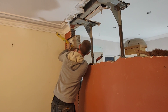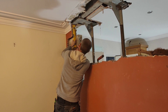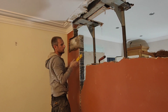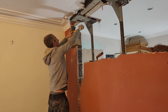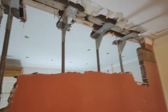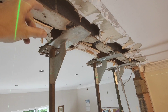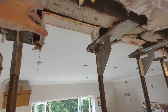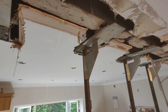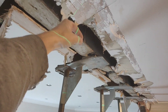If we pull that back a bit - up a bit more, yeah - it's quite a bit more up, yeah. It's a bit high up front. Right, I've got them set up ready for the steels. We've got a couple of shims under each end so the steel doesn't sink when we put it on, then we'll wick out this gap. We might have to dry pack some concrete or we've got some concrete brick. We're just going to put it on and see what it comes to because we can't squeeze it up anyway - we're going to have a gap. We'd probably have been better leaving that brick coursing and having it lower, but we wanted it as high as we could get it. A shame about those joists because that's what stopped us going fully up. Anyway, time for the steel - let's crack on.